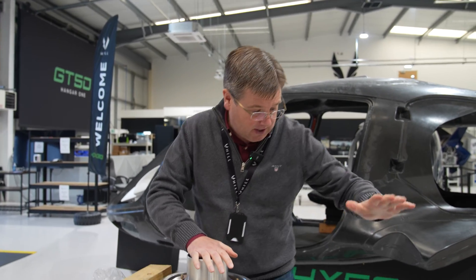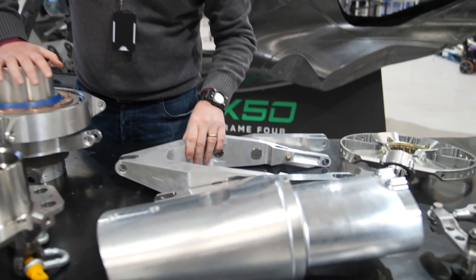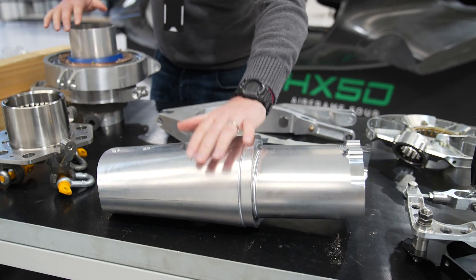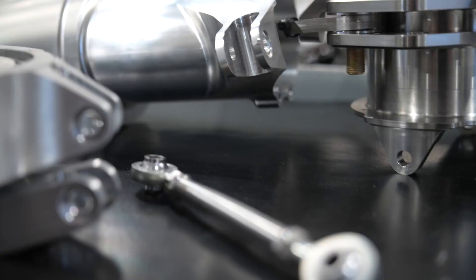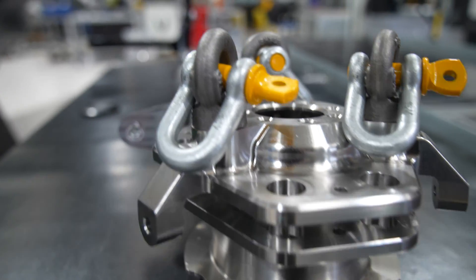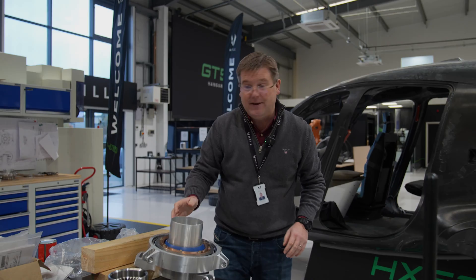That's the first one of those built up. This is the system here — the jack beams that connect to this via the pitch links and actuate it. And here's one of the finished cuffs into which the lag damper and the strap packs go. So all of this is being built up at the moment — really excited to see this lot come together.